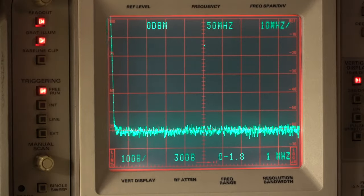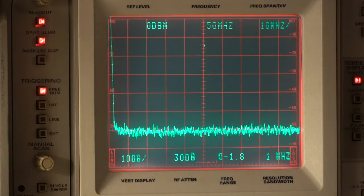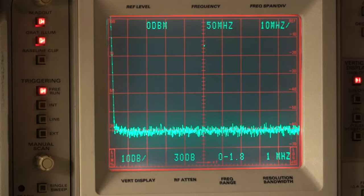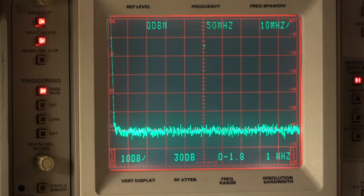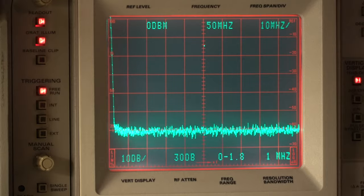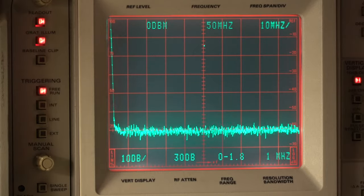In the vicinity of the carrier — remember those oscillations at 10 MHz plus/minus — those are gone. So we can assume the output is now okay. Why it is not fully 100 watts — only 90 watts — I don't know at the moment. Maybe as I said, a realignment will help. I'm quite sure we can now connect the low-pass filter and see whether we have any problem there.